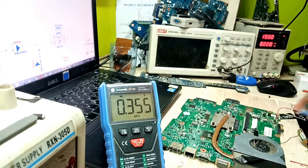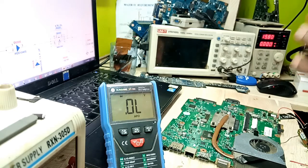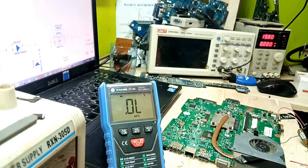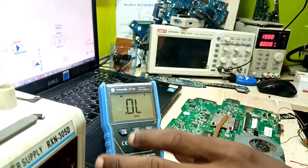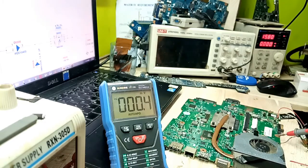As you can see, the impedance is high — impedance is fine. So how come 19V is still coming through? More detail will be discussed later in this video or in another video with my students. But let me explain strictly how your board can be affected by signals you think are unrelated to certain sections. Let's go back to check the input voltages of the switching IC, which is the charging IC.